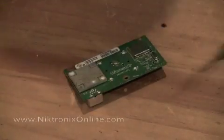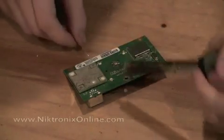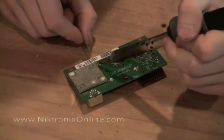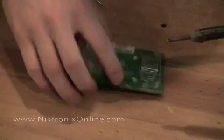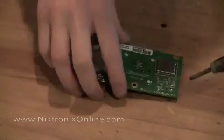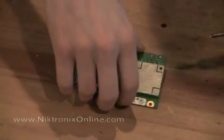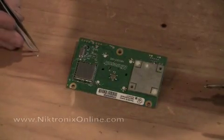What I do is grab a little bit of solder on my iron and come over here and just flow this pad with solder — it'll stick to that side of the LED. Come back and make sure the center connection is soldered well. And then we're done with the outside four lights and we can move on to the middle.